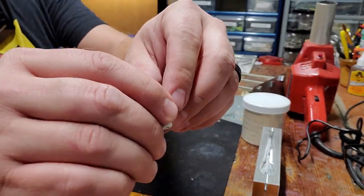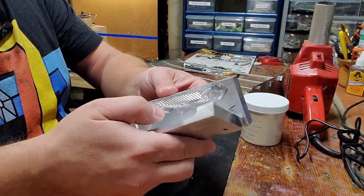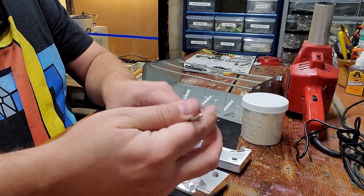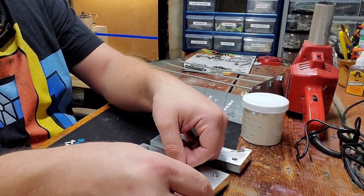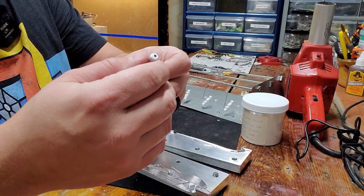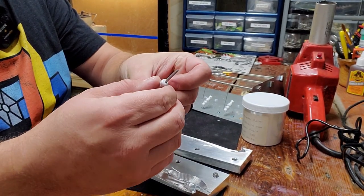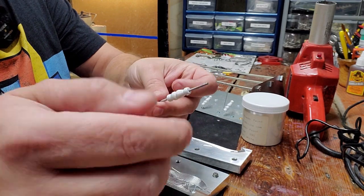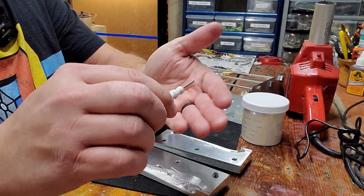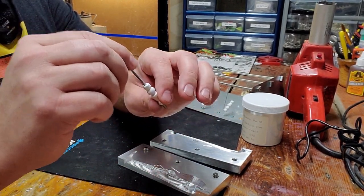So there it is. Okay, the true test, and this is the mold that we're going to be using in the next video. The true test is to take the pin that goes in the middle of the mold and make sure that this slides right on there. And if it's stiff or it sticks real hard, you definitely want to make sure that that's cleaned out real good. Run it down through that drill bit again. But this one is right on there and it falls. So I know it's good to go, okay?